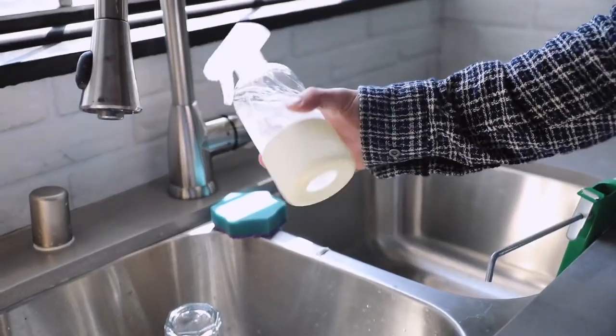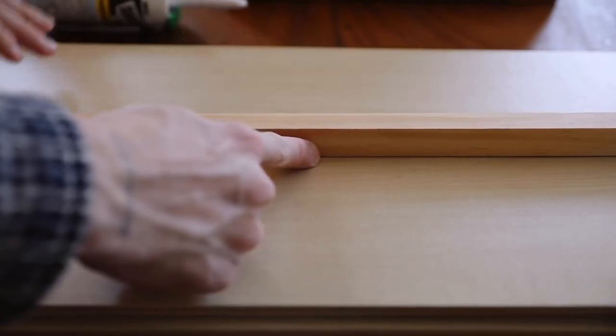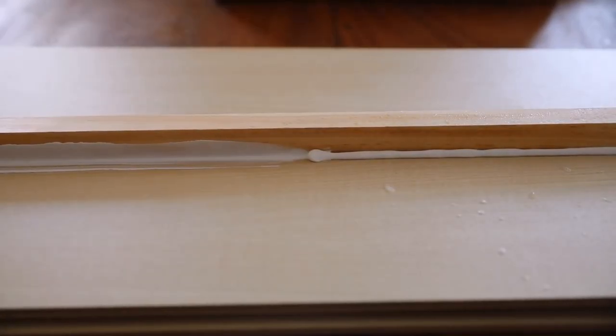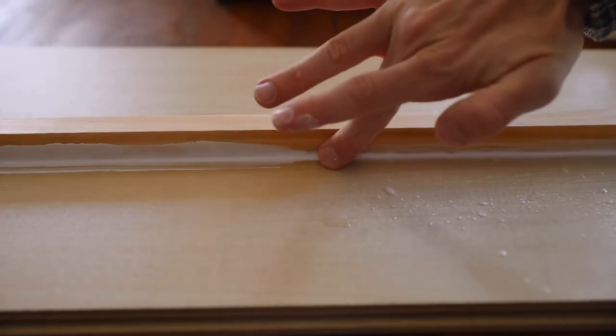We have just two more for you guys. This is a great tip if you're doing a lot of caulking — a board and batten wall, beadboard wall, baseboards, whatever it might be. This is basically to eliminate how messy caulking can be. Fill up a spray bottle with some water, add a couple pumps of hand soap, and mix that up. Then pipe your bead of caulking across whatever you're doing. When you just use your finger it gets really messy and kind of goes everywhere, but if you actually spray a little bit of the soapy water over the top of your caulking, it keeps it consolidated and in a clump, so it's so much easier to work with. It just smooths out across the baseboard or molding piece, it's such an easier cleanup process — it's not dripping, not falling, it kind of stays together.